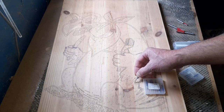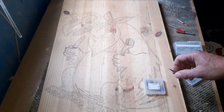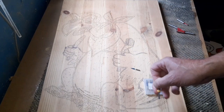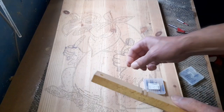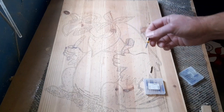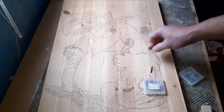We'll set the depth to about three millimeters — we don't have to go too deep since we're pouring resin in, and there's no point wasting resin. We'll do all the lines, going all the way around inside the lines and outside the lines. Never route on the line itself, always up to the line. Once we've done all the lines, we'll pop on an end milling bit to clear out. I use these to clear out on all my projects and I don't think we'll have any issues with this pine today.